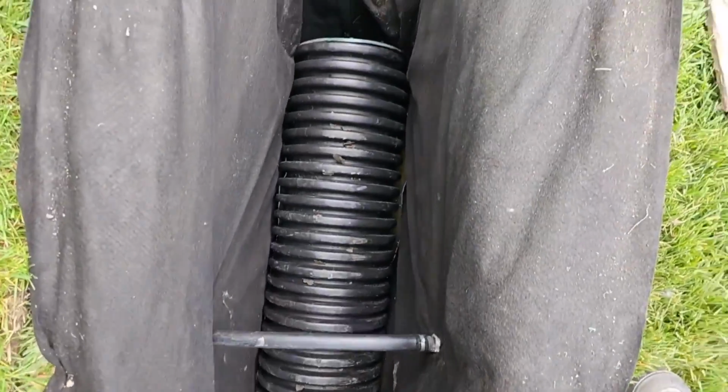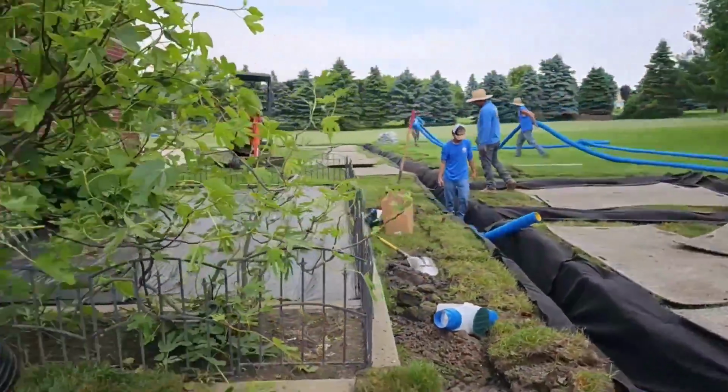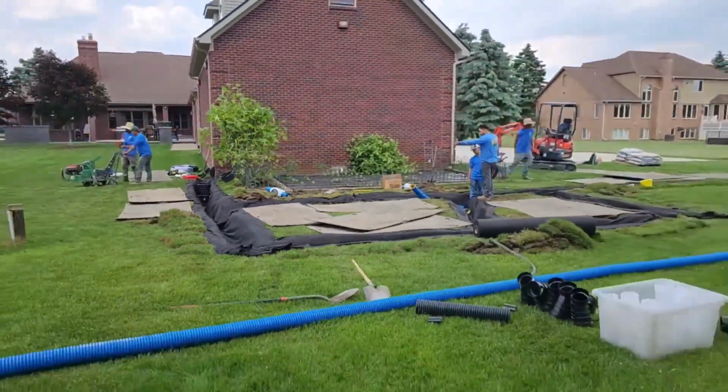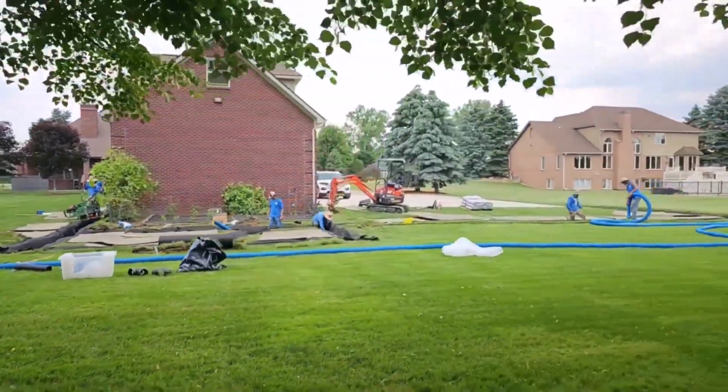So you need to be 12 inches below the bottom of your French drain trench so that you don't hold water in your French drain trench. Otherwise, if it was the same height, you'd have up to 10 inches of water in your French drain trench before the sump pump would turn on and then pump it all down.